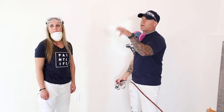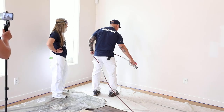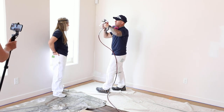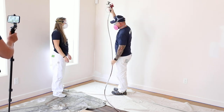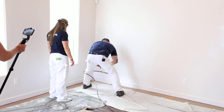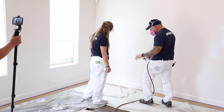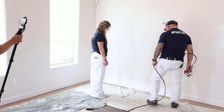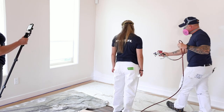This house doesn't have trim around all the windows or door jams, except the two entries, so we only have to spray two door jams. I'll do short sections and runs — spray the top of the baseboards and then the face of the baseboard. Just like that, nice smooth consistent speed. One pass over the top, two times on the face. Look at it — see how it looks. Safety first — putting on the mask and eyewear before spraying.